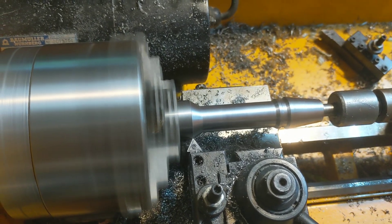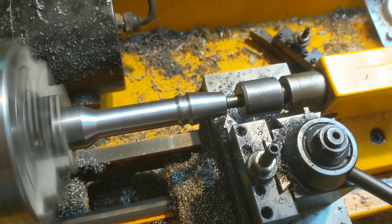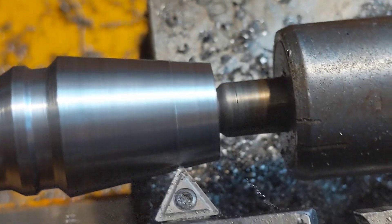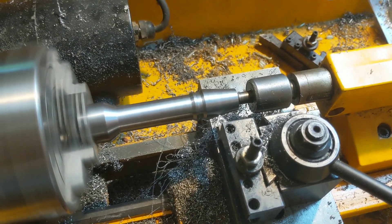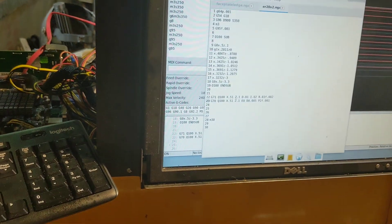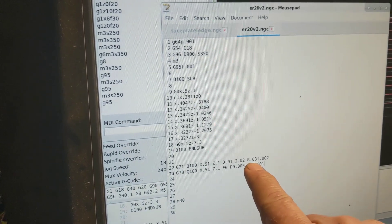Alright, now if all goes well it should go back and do one final cut of five thousandths. That's cutting pretty good, for this purpose for sure. I have to say, that's pretty neat. This is LinuxCNC — this is the profile right here. And then it's two commands that call that profile: the roughing one, which is what you saw roughing, and then a finish cycle.